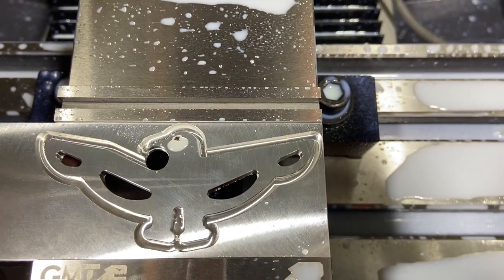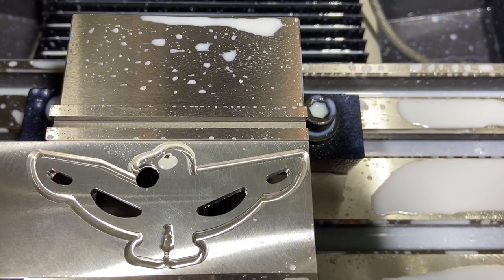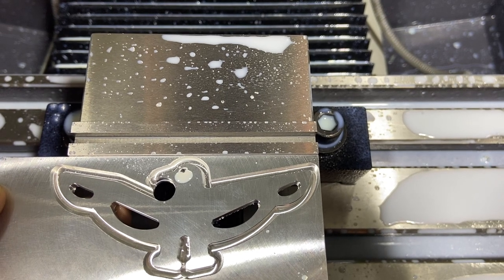I know it only cut 185 deep. I know my piece of titanium did actually clean up closer to 190, so I need to go readjust the thickness and just make it cut through an extra 10 thou or so on the bottom side of these.